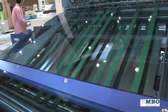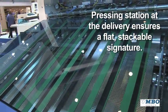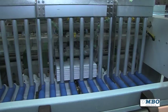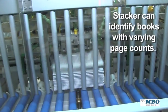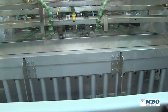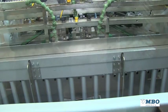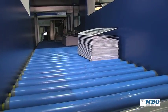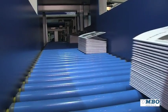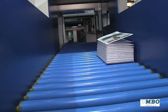Now you see signature folds being put into a very high speed stacker. Now you see book blocks being produced at variable page counts. We are able to monitor codes and cycle the machine based on the page count of the book. Good book blocks come down this conveyor, while bad books will be pushed by that paddle conveyor over into a recycle bin.